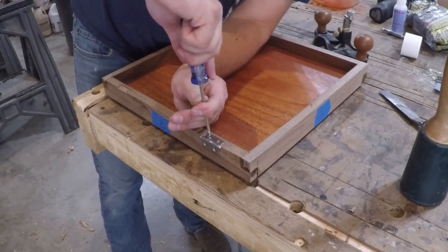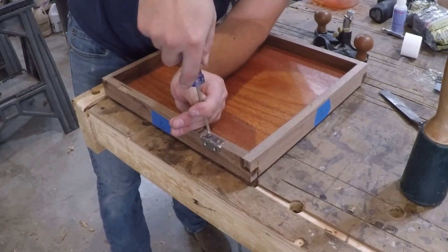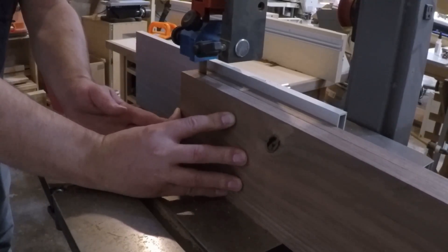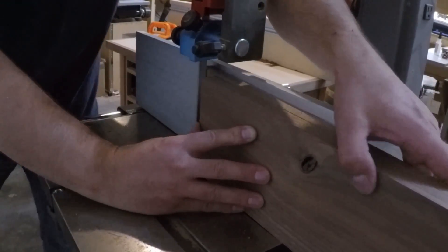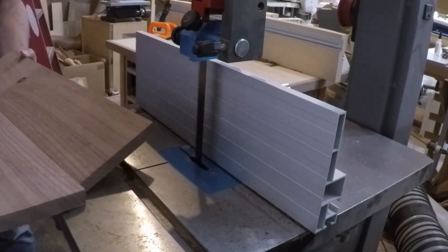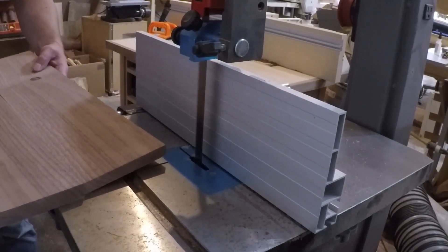To be sure I didn't strip out any screws or scratch the heads, I drove them in by hand and test fitted each one before applying the finish. I'm now moving on to building the interior of the box to hold the shot glasses and whiskey bottle. I resawed some 8-quarter stock so the grain on the boards for the left and the right glass holders would be bookmatched. I just love those kind of subtle design touches.